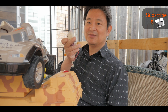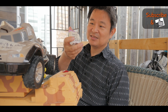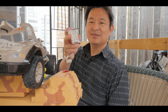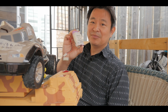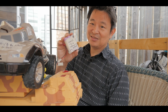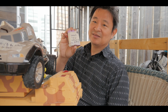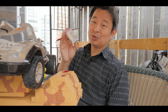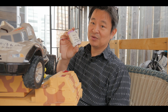This is 9.6 volt. I have an 11.1 volt that I put together — this is a lithium 18650 battery from a laptop, actually. So this is a recycled lithium battery I got from my laptop battery pack, and it's free. I was able to solder it together and keep it in series, so now it's 11.1 volt. Each individual cell is 3.7 volt, and when you connect them in series it becomes 11.1 volt.